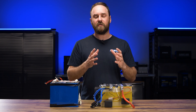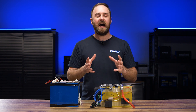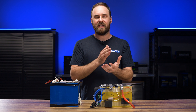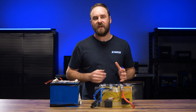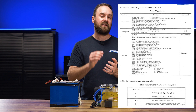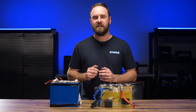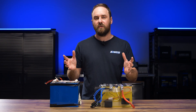This leads on to cell grading, as in a grade A, grade B, or grade C cell. This is a bit of a dark art because every supplier, manufacturer and seller seems to have a different definition of grade A. But a true grade A cell must hit a list of predetermined specifications at the time it's manufactured according to the manufacturer's spec sheet. It needs to be the correct capacity within a couple of percent, the correct voltage above a certain threshold, and the correct internal resistance. Not only that, it needs to look physically correct and be the right overall dimensions. So it's really hard to know just by looking at them.